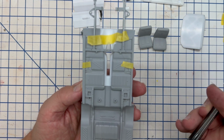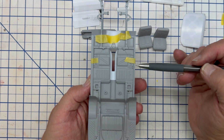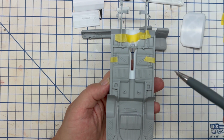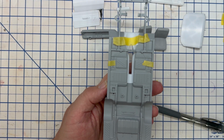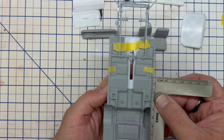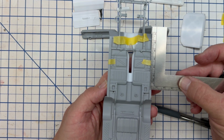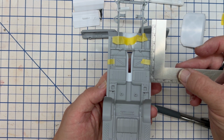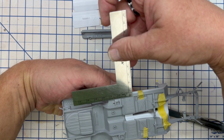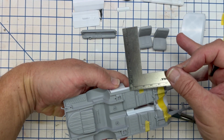And in fact, I'm even looking now at the under frame. See this rail versus this rail. This one is wider. Let me grab my measurement here. That's not the best. Yeah, it's about 1.5 millimeters, where this one is 2 millimeters for sure. You can see that.